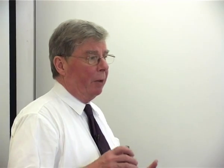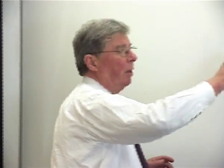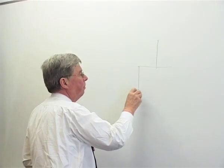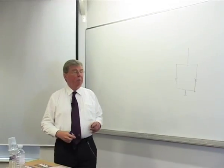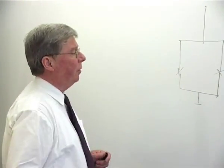As soon as people realized that single junctions gave these diffraction pattern shapes, and that they were periodic in one flux quantum in the junction area, they realized they could make it periodic in smaller fields by having a bigger junction area. What they did was take two junctions in parallel, effectively attempting to mimic the experiment in Young's fringes — going from a single slit, which produces a diffraction pattern, to a pair of slits, which produces an interference pattern.